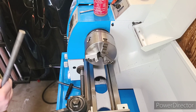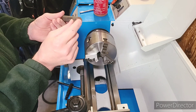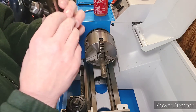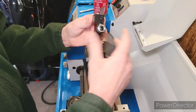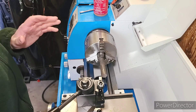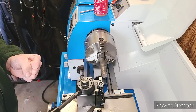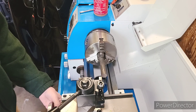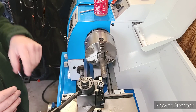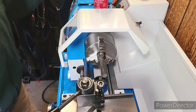So this is what we're going to be cutting — just a piece of 1018 steel. We're going to go ahead and face off this side that I cut using my evolution chop saw. We're going to use a right cutting tool; the blade is on the right, which means this tool travels from left to right. First we have to do something called touching off: we move up to the part, touch it, bring the cross slide back, lock our carriage, and reset our dial to measure how far in we want to move. Let's fire this up at 150 RPMs to start.